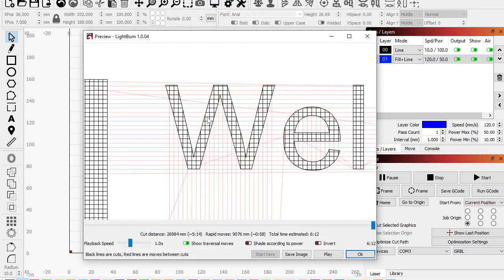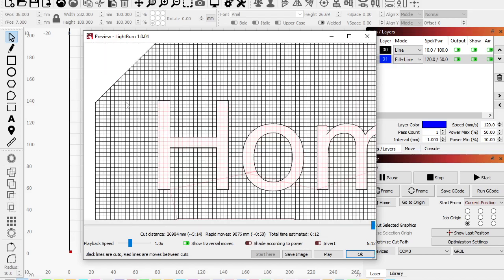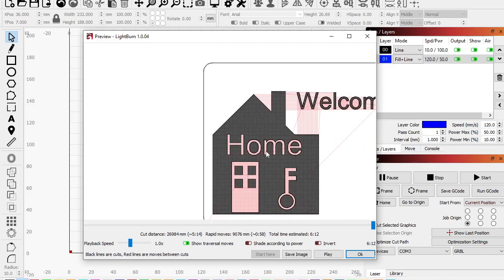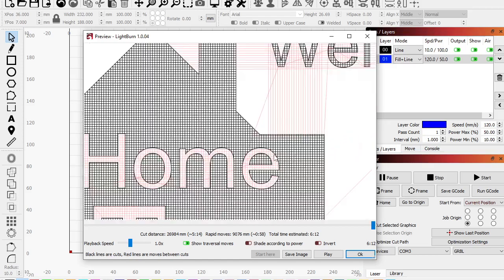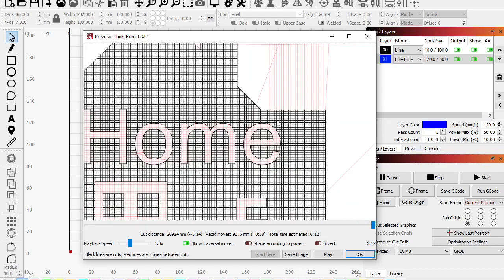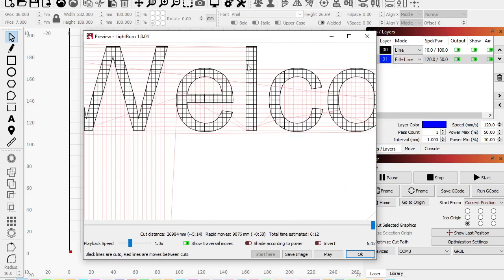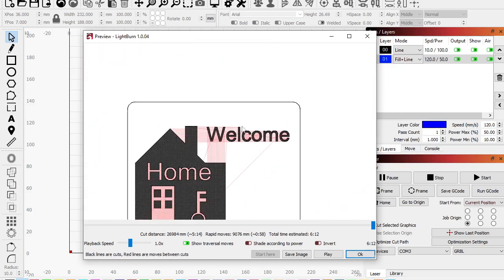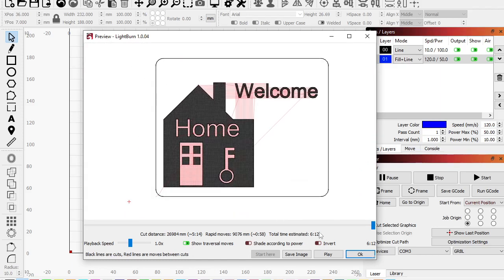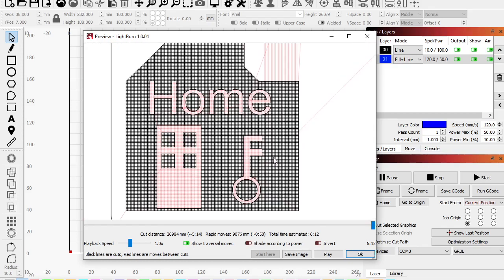And yeah, right here it looks like this crosshatch. It actually turns out really cool looking. So instead of being like this big divot, it's this deep dark pattern that shows up, except for where the wood shows, right? So you get nice wood grains. You get the continuation of wood grains through the pattern. It's a cool effect. One of my fellow Makerspace members showed me this. But we went from 22 minutes to 6 minutes, 12 seconds by changing the infill pattern, basically, here.